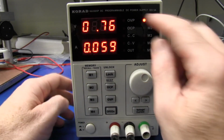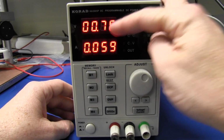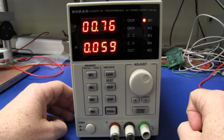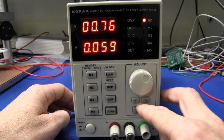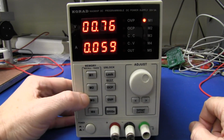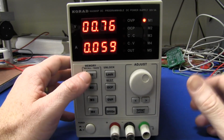But yeah, it goes all the way down to 0 volts, and as you can see, it automatically switched out of that mode there. If we press enter, it'll automatically jump back out if you don't touch the optical rotary encoder in like 5 or 10 seconds. So setting and adjusting the voltage and current works quite well and quite intuitive. I like it.